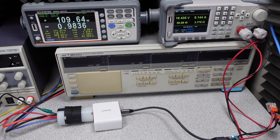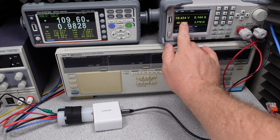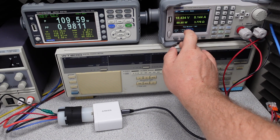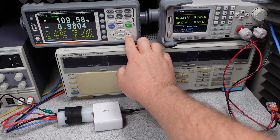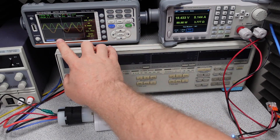As I turn the load up in the 20 volt mode, I notice the DC voltage starts to sag a little bit on the low side. The 20 volt output dropped to 19.4 volts DC at the full 100 watt load. This is about 3% low and is a little outside of the allowed voltage drop by the USB specification — 20 volts plus or minus 0.5 volts. For a 20 volt mode, this is a little lower than the USB Power Delivery specification.